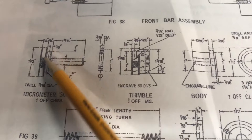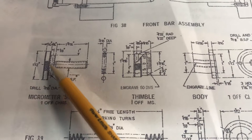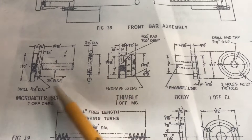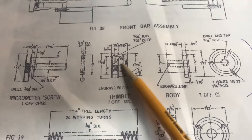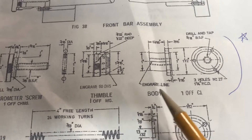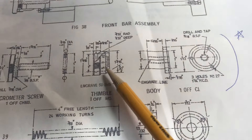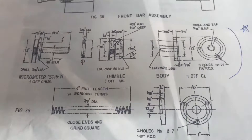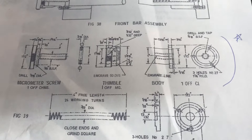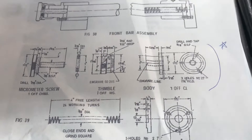The last part, which should be relatively easy to make, is a screw with a round handle — what's called a knurl — and the interesting dimension to it is a little shoulder drilled through for some 3/16 inch balls and springs. That's going to be an interesting part of the project to make. It keeps contact with and keeps the thimble kind of steady so you can rotate the thimble in relation to a line engraved on the body, then twist the handle and the thimble moves — giving you control over depth of cut on the bottom of an end mill.